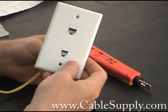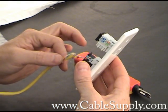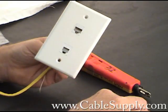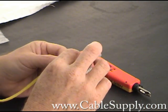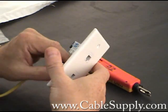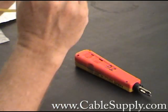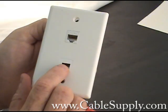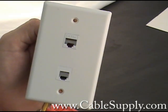It ends up with a nice smooth finish once it's pushed in. Don't cut your other wires because you can always add other RJ11 six-position jacks to that location. You can also use this little cap — it fits on the back, snaps in, and keeps things in place. I don't always use it; it's not necessary. Remember when you put in the jack that the conductors have to be on the top side of the jack to keep the dust and dirt off them.